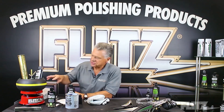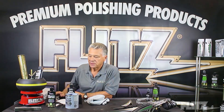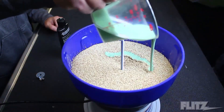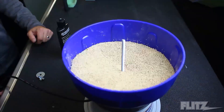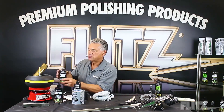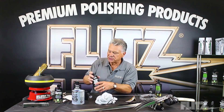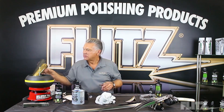Now, when people see it in my tumbler here, they always wonder: what is this device? There are tumblers or vibrators, as they call them, and these machines are designed to shake very, very quickly. This is what we call our tumbler media additive — a thinned-out version of the Flitz polish. Because it's thinned out, you can pour it directly into the machine. For a machine that carries basically a pound of media, you're putting in one capful per pound of media. You're pouring it directly into the machine itself, and as the machine turns and tumbles, it mixes the additive with the corn cob media and gets saturated.